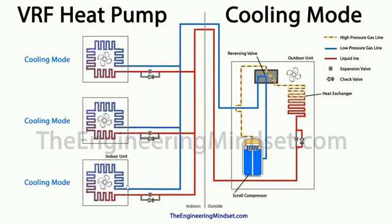So by the time the refrigerant leaves that cassette in the cooling mode, it's going to be leaving as a low pressure, low temperature saturated vapor, and the force of this refrigerant, which is constantly being pushed around, is going to be forcing that refrigerant back round again into the reversing valve, through the U-bend and straight back down into the compressor.